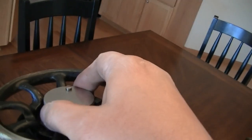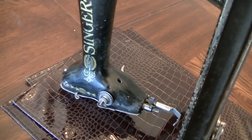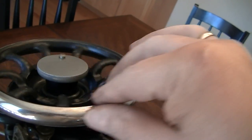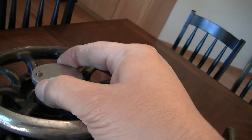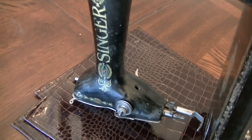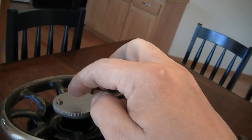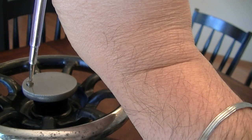And once it is completely tight, completely jammed, then it will lock the movement, and the moment the drive shaft will start moving with this hand wheel. At this point, make it a little bit loose, so that the drive shaft is not locked and movement is not working. This is the exact right point when this screw should be made tight.